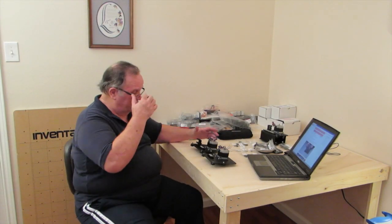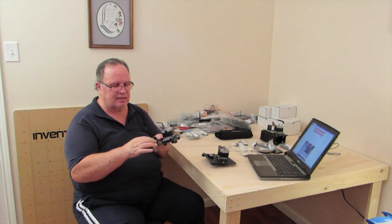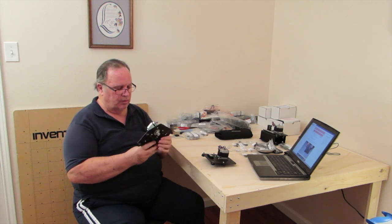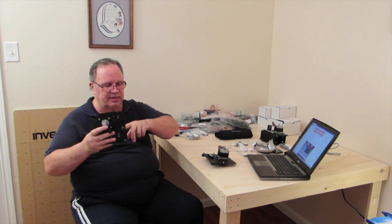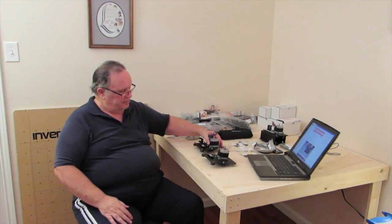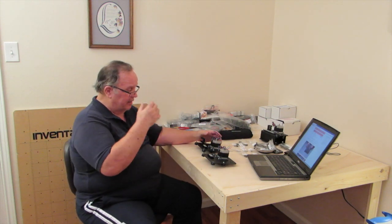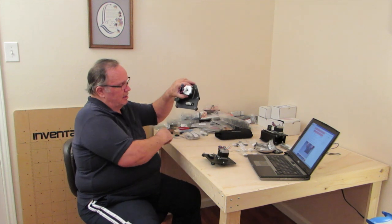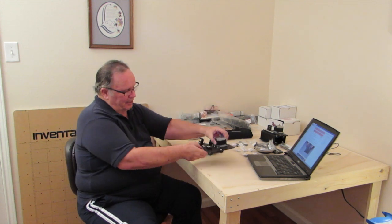Back again. I found all the parts and completed putting on the drag chain link mounting brackets on the Y plates. The drag chain link will come in here and loop back around — all the cabling will be in that drag chain link, and as this moves back and forth along the rails it'll keep the wiring from becoming knotted up in the mechanism. Also, the next step which I went right on into was mounting the four-termination terminal strips on each plate, and I got that done.